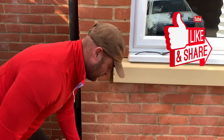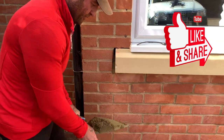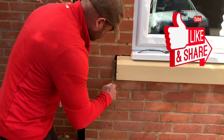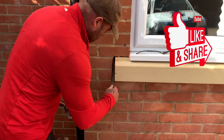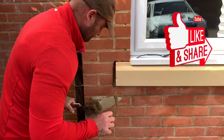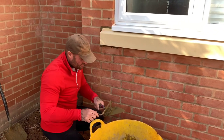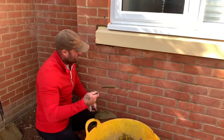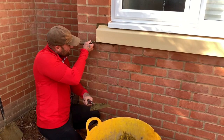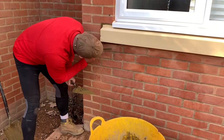Really compress. See the mortar we've used from knocking up — it's almost squeezed to the hand. Nice and dry. Bit of a pain when we're pointing up. Use a flat tool. Really compress that muck in there. Get a little pressure on her.